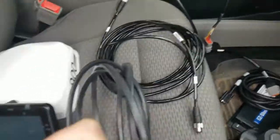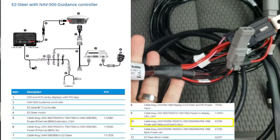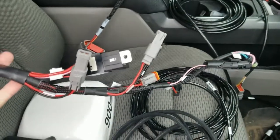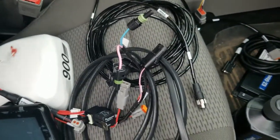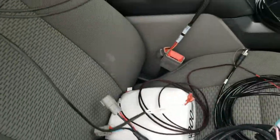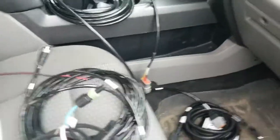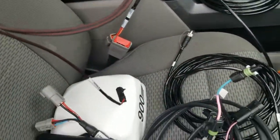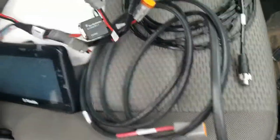That is going to plug into the 67259 cable — it's this big power bus cable. It comes with two connectors, P2 and R2, disconnected. You have the option of using a power switch for turning power to the steering system on and off. Most people discard that cable. There's also another part that goes to keyed power, which most people also discard. So the 67259 cable is actually a three-part cable — we're going to be focusing just on this main power bus harness.